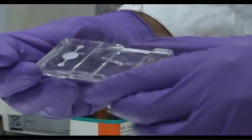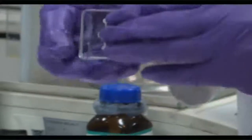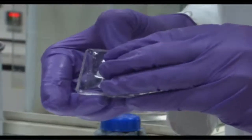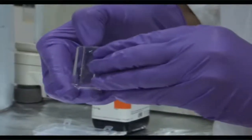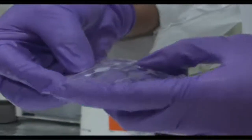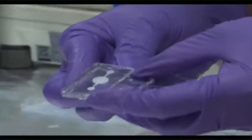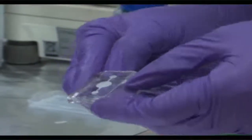You can see that it's quite thick. The surface on which we wanted this microfluidic device to be embedded is actually the thinner side. So what we have to do is a slow retrieval of the laser micro machined PMMA from the PDMS, from the lower side. One has to be extremely slow in removing it, because otherwise there may be stiction. An irreversible seal is developed on the surface, and so the stiction may cause damage to the device structure.